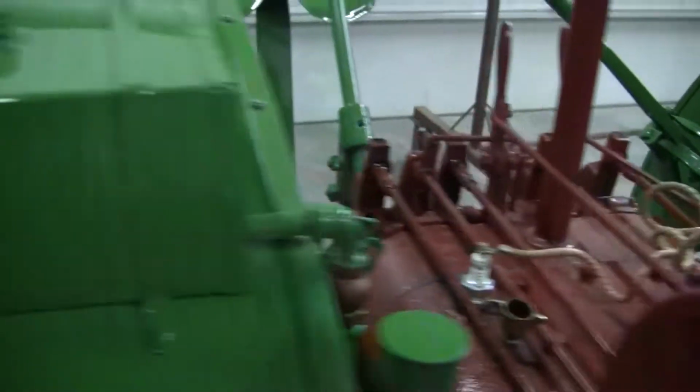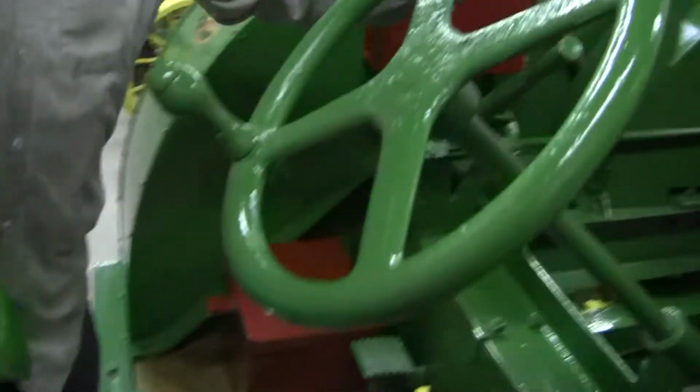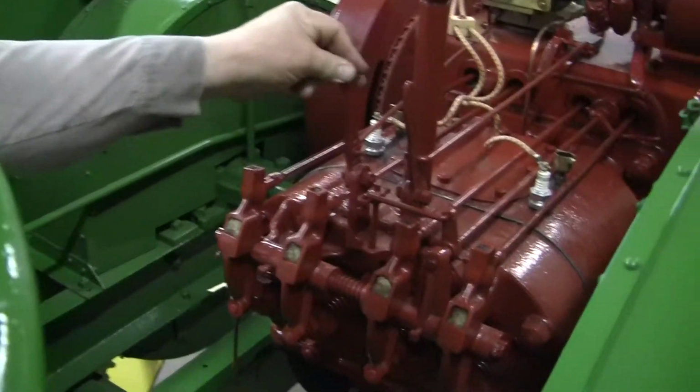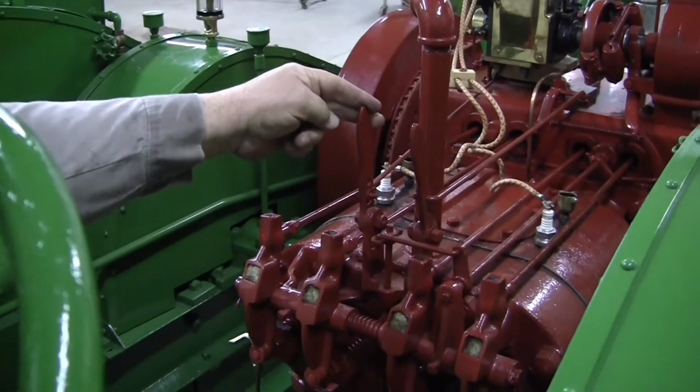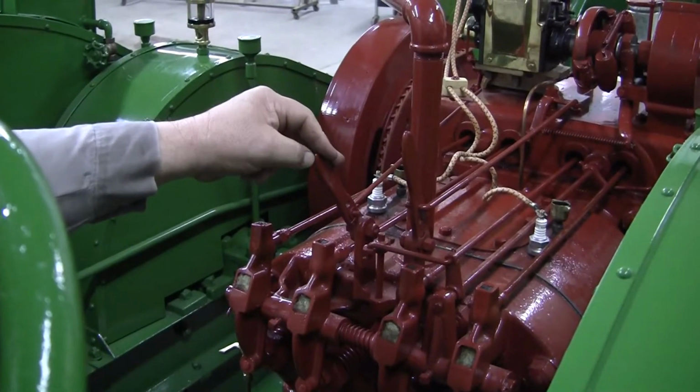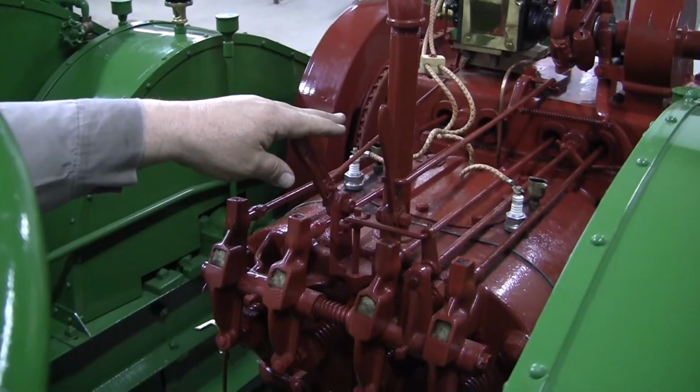And normally after I get it running for a while, this is retarded in advance, and if you're driving around, advance a little bit, but if it's sitting around idling, I usually pull it back to full retard and let it talk at a retarded pace.